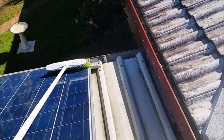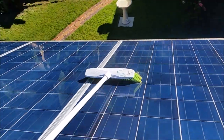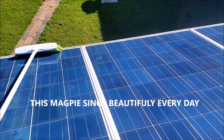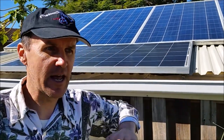Just gently scrape off anything that is rock solid — hopefully it's not rock solid once you've dissolved it with water. When you finish cleaning the panels, if there is sun, go back to them once they're dry. You will see clearly where you missed some spots and then you can revisit and finish cleaning completely.